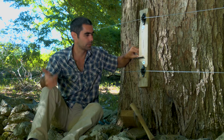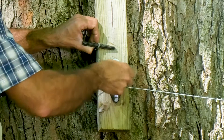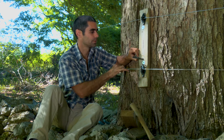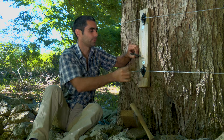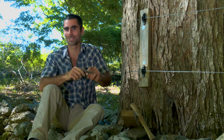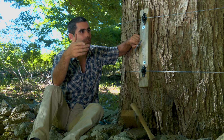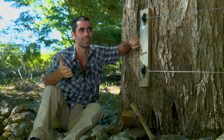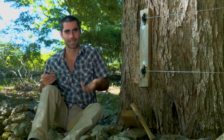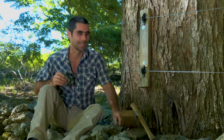I've used these. They're nice and inexpensive. But I like the board system a lot better because with the tubular insulators I can't easily drop my fence. With the pin system, dropping the fence is easy, but with these I'd have to pull the staples. The other reason I don't like them is I have to count how many insulators I need before I go down the line — I might think I need 10 and then realize I need 11 and missed one in the middle. It's a pain, whereas the board system requires no counting at the start.